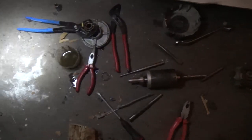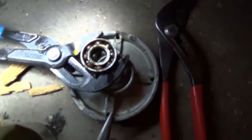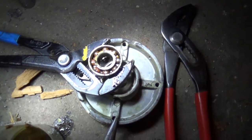The problem we've had is the chilled water pump wouldn't turn over — it was just humming. We took that apart; two pipes come into it. What we found is where it's been sat, water got into the front bearing and seized it up.